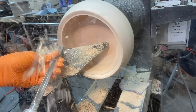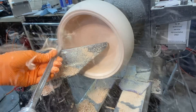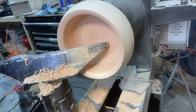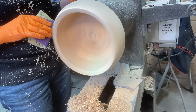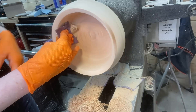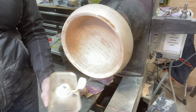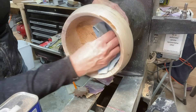Making the final shape of the rim, going for a simple slanted-down rim. Starting the sanding process at 80 grit — I don't show all the sanding, but I do sand from 80 to 120, 150, 180, 220, 320, and 400.